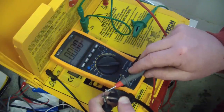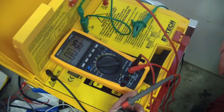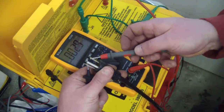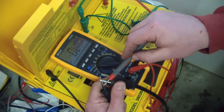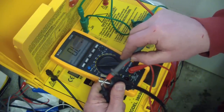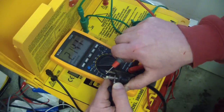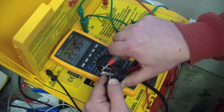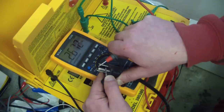I wonder if we'll be able to read it with the old Fluke 87. We're going through the motor — so three ohms. It's showing overload there. Let's try the other one — and look at that: only 2k ohms. So that is why the ground fault interrupt is tripping out. It'll probably settle out at 3k — seems to be some capacitance there somewhere.